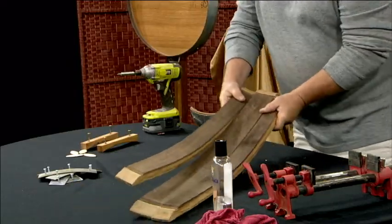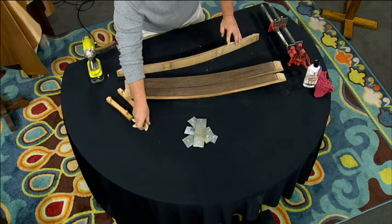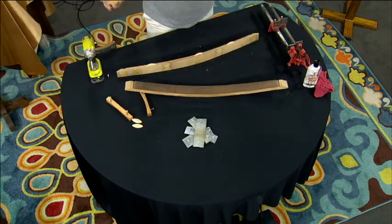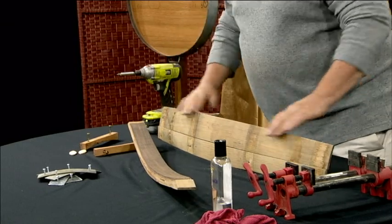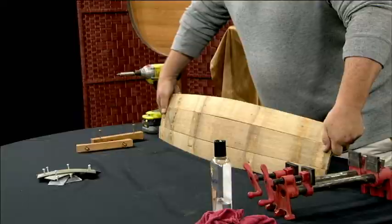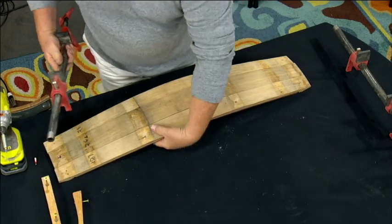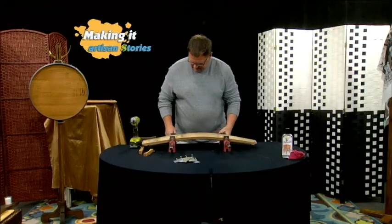So what I'm going to do is put it together. Again, it's already been sanded. I'm not going to glue them — I don't want to get into too much detail. So I take the biscuits, put three biscuits in it to hold it tight like that. Then I take another one, put it on top after I glue it. Put three more biscuits in like that — missing a biscuit, but that's okay for the show, you can see what I'm talking about. And you go like that — it's all tightened up. Then what I'll do is clamp it overnight so it's nice and tight, and I tighten them all down.